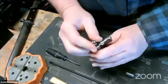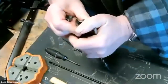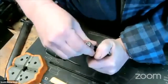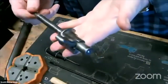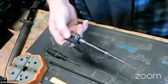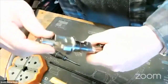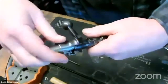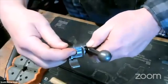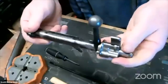It's just kind of the same — you just push down, get it lined up, put this top back on, rotate it into position, and it's back together. Notice I have the safety in the upright position. Now this drops right back into the bolt, and then it just screws back down into place to a certain point. You might have to depress this detent again where my thumb is — push it and let it rotate around, and you'll feel it click into place.